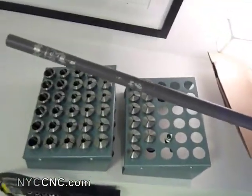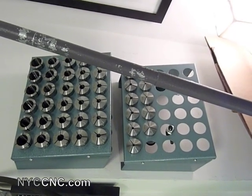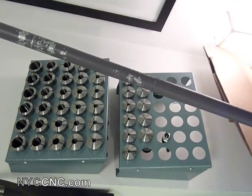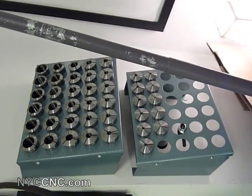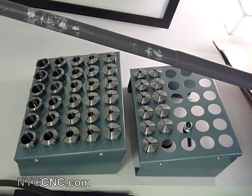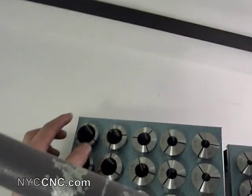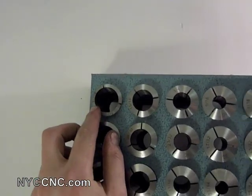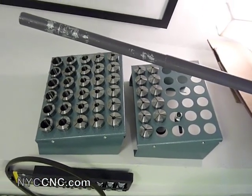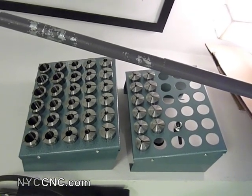I also wanted a collet which allowed for through-hole passing. You now have quite a bit of room to hold stock in the chuck, which compares favorably with some other collet chucking systems that don't allow you to pass through. The really only other option was the ER32, but they don't go as large in size. The largest 5C collet is one and one-eighth inch. The ER32 chuck was similarly expensive, or perhaps a hundred dollars less, but certainly wasn't a steal.